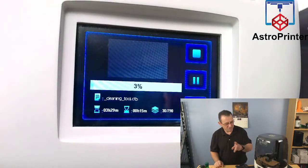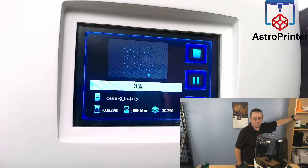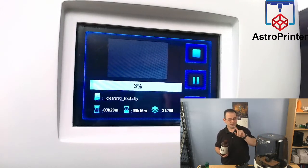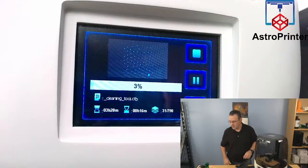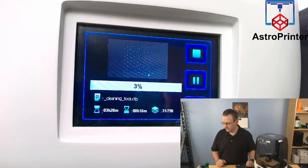You went with the Skins regular resin. This is an ABS style resin. It's not actually ABS, but it's ABS style resin. This white one that I offered to do. But I have seen ABS resins dissolve the surface of an ABS vat, so I don't like those. I think all vats should be aluminum. There is a company out there who is actually making ceramic vats now.